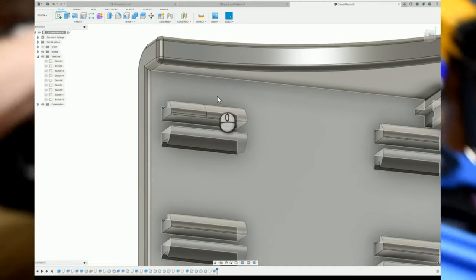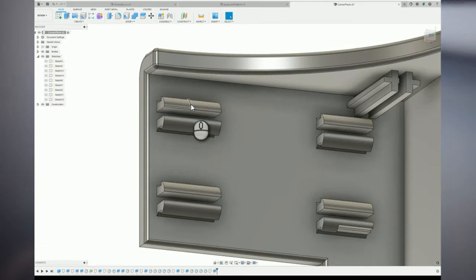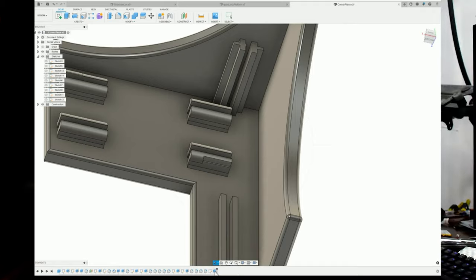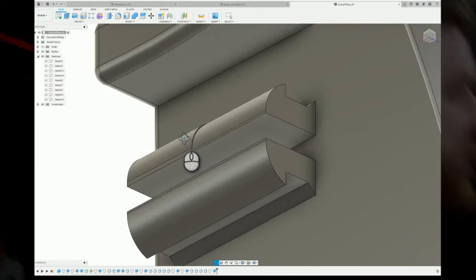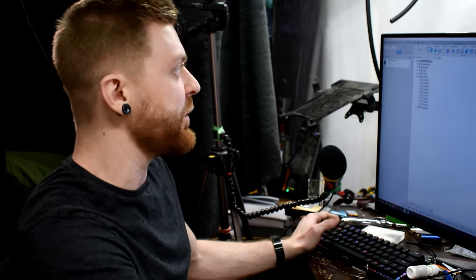This is an oddity — this is weird. Why did that happen? I have no idea why that happened. That happened over here too. This is an extrusion problem — I cut something. I went too far with that. So I don't know what's going on. Although that could be as simple as just driving screws into it, if I don't want to get too fancy on at least one of them, and then add screw holes on the other three where it makes the most sense. PETG, just for your knowledge — I printed at 40mm per second on this printer, at 252 degrees, and that's just what I found works best.